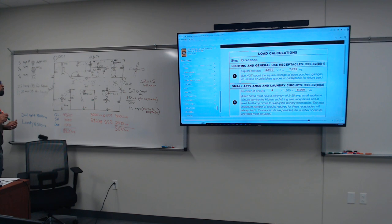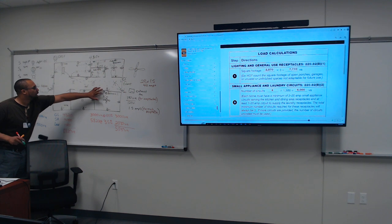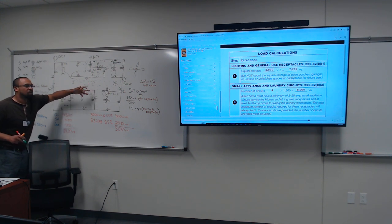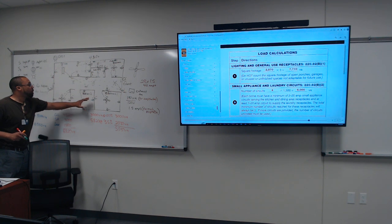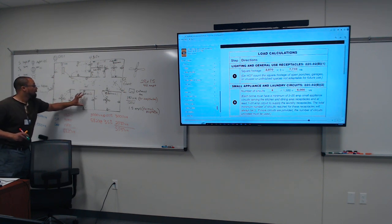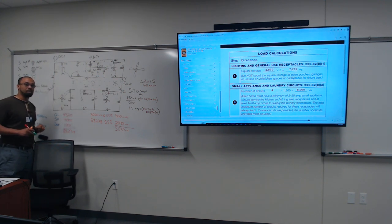Do I want to put the hallway plugs on there? You gotta calculate. So we're already at 12 amps with these 8. Then 1, 2, that's 3 amps. So 3 amps plus 12 is 15, right? I'm asking y'all. Yes. Right? So now we can put bedroom 1, bedroom 2, and these hallway plugs on a 20 amp breaker. Y'all see what we're doing?